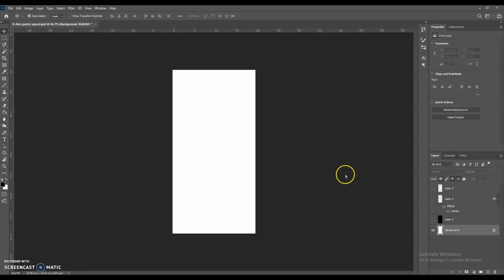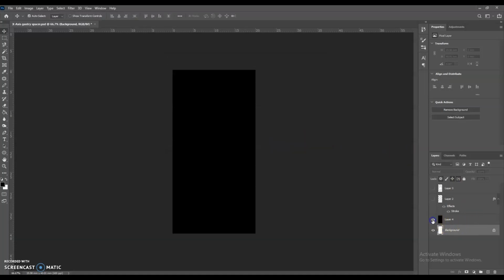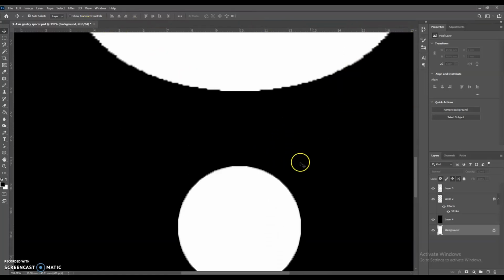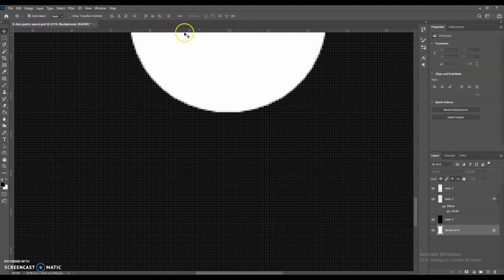So I'm just going to quickly try and show you guys how I personally went about creating this file. I'm familiar with Photoshop, so I used Photoshop, and I opened up an image that is exactly, well, almost exactly 20 by 40 millimeters. And I made a black background. I put 2 bolt holes and then the clearance hole for my cable through the middle here. And really I just kind of used this ruler right up top here just to confirm these sizes. Hopefully eventually I'll get better at generating these files.